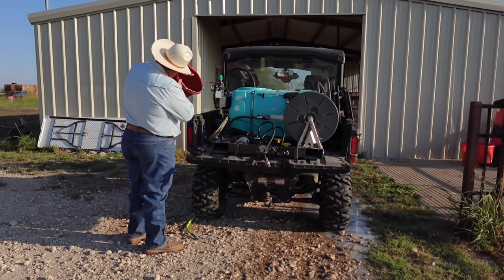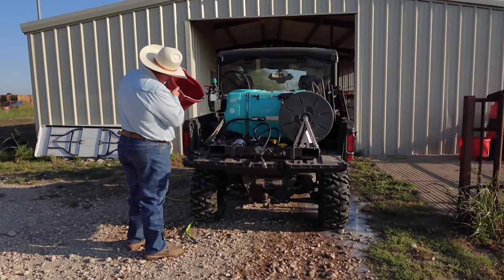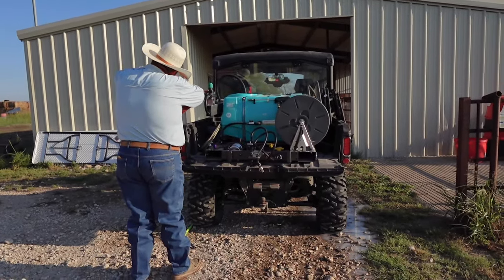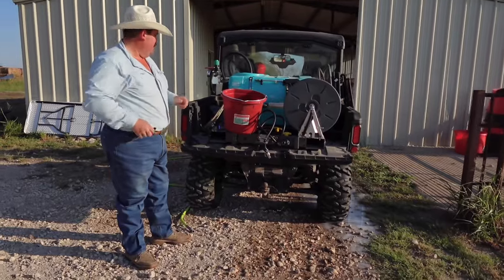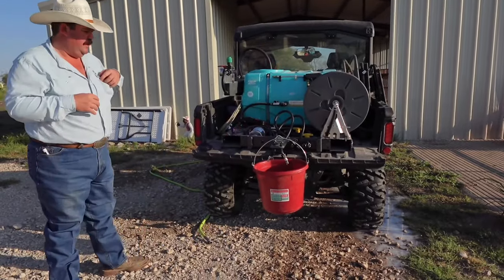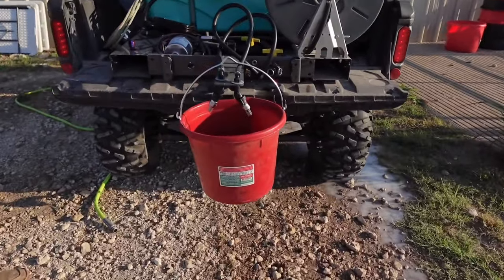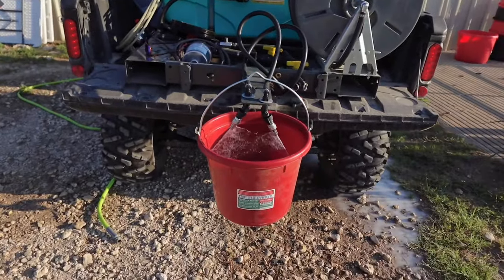There's liters, quarts — four quarts in a gallon. Let's just run it. I'm going to put a mark in here, guys. Right here at eight, that's going to be two gallons of water. So we're going to run it and see how long it takes to get two gallons in there. I've kind of already adjusted my spray nozzles so that for the most part it's going to go in there. Clance is going to crank the buggy up, and then I'm going to turn the spray on and start my watch.